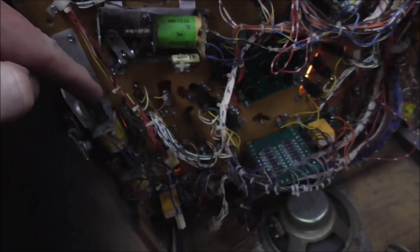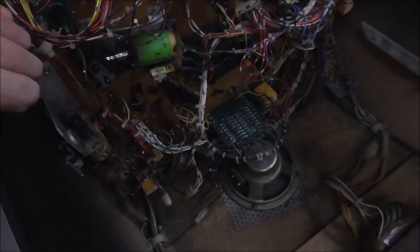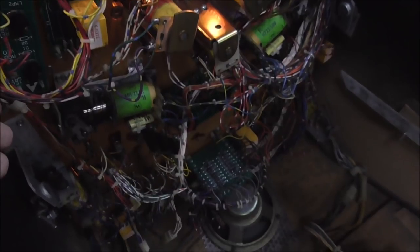And the spinner and the gates are these little things here. A wire goes through the play field and connects to a big flat blade that's pulled up, connecting the switches together. They were just dirty. So those three are fine, the two gates and the spinner. So I don't have any that are CPU problems. They're all broken wires or dirty switches. So that's pretty cool. But we do have to figure out the coin door ones. So we'll figure that out. But let me solder these three wires back, and then we should be able to lay the playfield back down and test those few that we had problems with before and see if they're working better now.